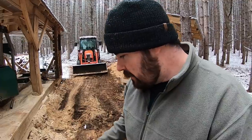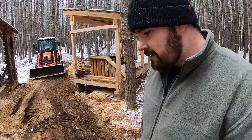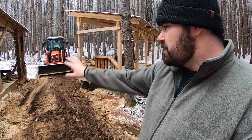I am aware of what's on the ground here. There's no stumps or rocks or anything. When you're back dragging like that, I am aware you got to be very careful. You'd hate to bend the cylinders on the tractor. I was in float mode, which more or less allows the loader to follow the contours of the ground. But regardless, if you hit something solid, you'd hate to damage that tractor. That took care of things nicely.